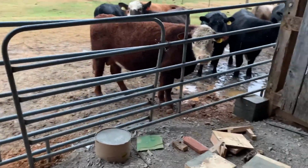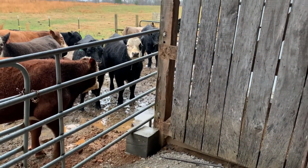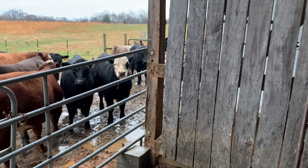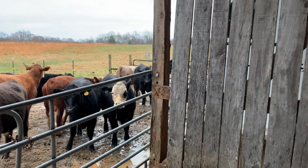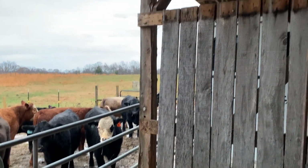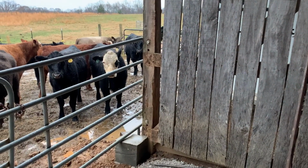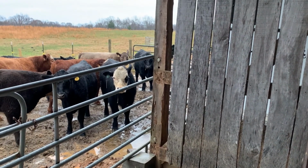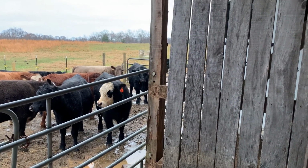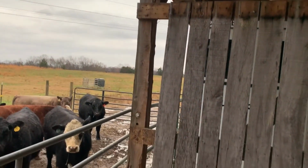And so I squared that one up, dug it down. That's a cedar post on the corner of that barn, and you can see where some of the rot and termites, carpenter bees have been eating on it. So what I'm going to do is fasten one of those 4x4s to that for structural support of the hay barn as well as the sawmill shed, and take it all the way up to the top. So I'll get the measurement and get that started there.